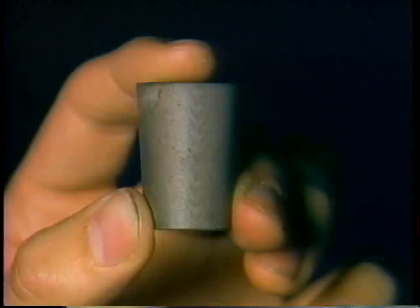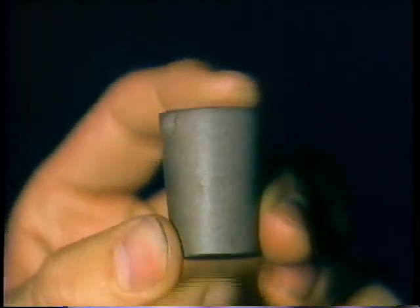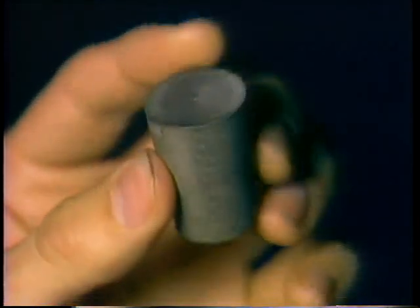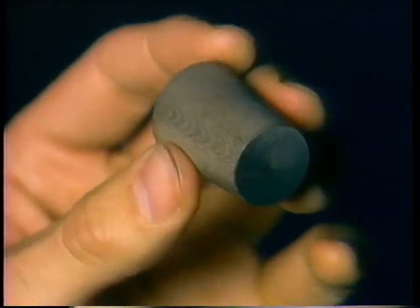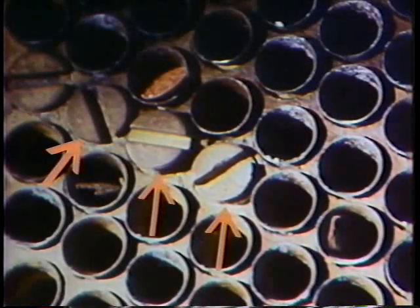What kind of plug to use may be chosen by the component's manufacturer, or your plant may have special requirements. The most common are made of a fibrous material and are shaped like the stopper of a bottle. They're tapered so you can fit them into the tube ends and then just hammer them in tight. They'll stay in place partly because water pressure will push in on them. Also, the fibrous material of the plug will tend to expand when it's soaked with water to hold the plug in even more tightly. Some of the older plugs used in this condenser have slotted heads — they're threaded plugs that screw into the ends of the tubes. They cut their own threads sort of like a wood or sheet metal screw. The threads grab into the metal of the tube and hold tight.